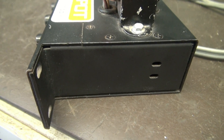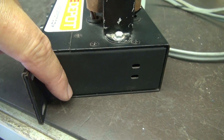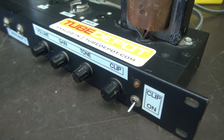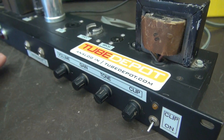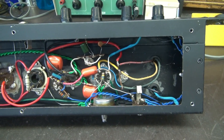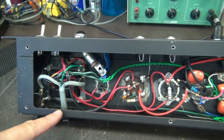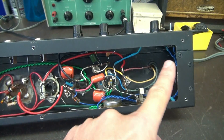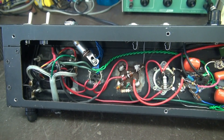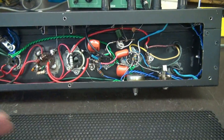Here's a side shot of the chassis. This is how the hush unit was originally made — it had a U-shaped shell that went completely around with no access. The old circuit board that used to be in there was supported by the knobs, just sitting in there horizontal with some standoffs. To convert it to a tube amp, I needed some access, so I milled this opening. It was quite the job — had it clamped down, milled away, and then added this nice perforated metal bottom with some feet.